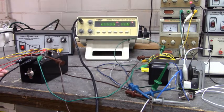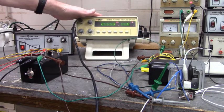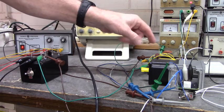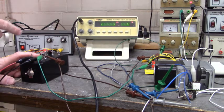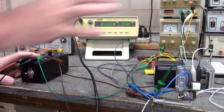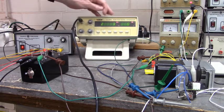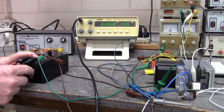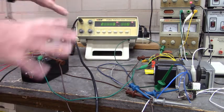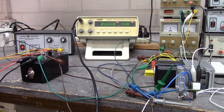Let's set it up to run that Schneider Electric stepper motor. Here we go. We have the output of our offset adjust circuit for the Victor function generator going to our level shifter. I have an on-off switch right here that disconnects the output from the circuit that you're testing - that way when everything's hooked up you can get it set to the right frequency and the right waveform before connecting. I'm going to turn the output on - and look at that, we're running!